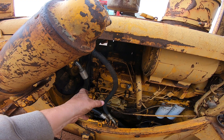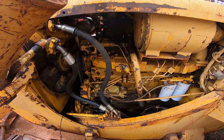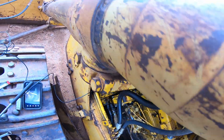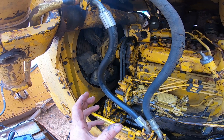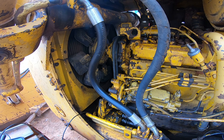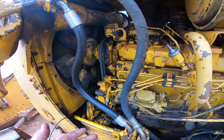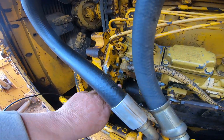Here's the problem I was having: I was trying to time it off the distributor head timing mark, and you can't do that because there's a little bit of slack inside there. It's also got a feature that won't let it run backwards — so if the engine ever turns backwards, the timing mark won't move. I was trying to time it off of that, and I figured out that was wrong.